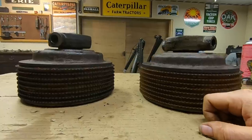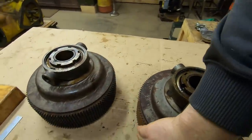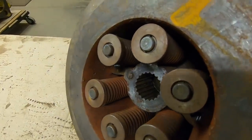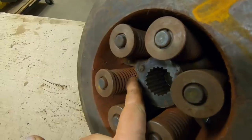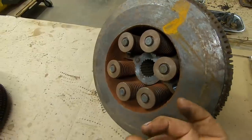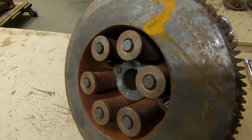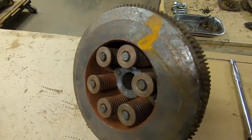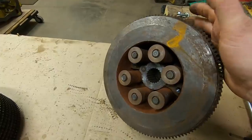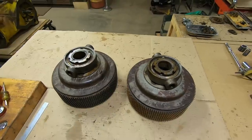So we're a bit on the fat side with these — not really sure why. But I wouldn't want them to be much thicker because we're already just about coil-bound on our steering clutch springs, meaning those coils are just about touching and you're just about out of any further compressibility to release the clutch. If those coils are already stacked on one another, you can't compress them anymore and you can't disengage that clutch. So we have a starting point — let's take them apart.